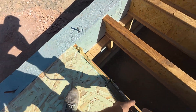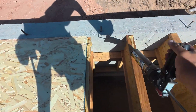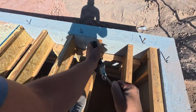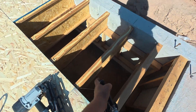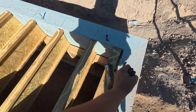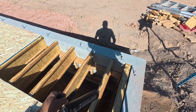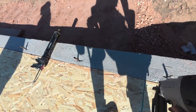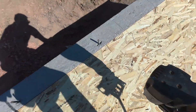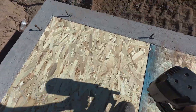One thing you'll notice is that as we go through this series, we do not have anything keeping these joists from tipping side to side until we put in the sheeting. The sheeting literally butts into and is flat with that concrete. Now we're grinding the concrete because it's going to be a tad high, so it's perfectly flat. Then we shoot that onto all the joists, which will keep us racked and prevent our joists from ever wanting to tip over in the future.